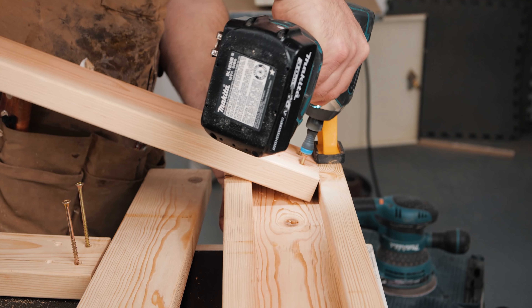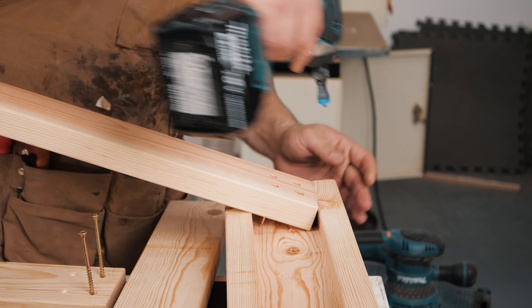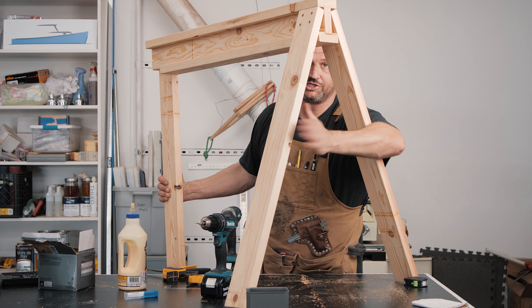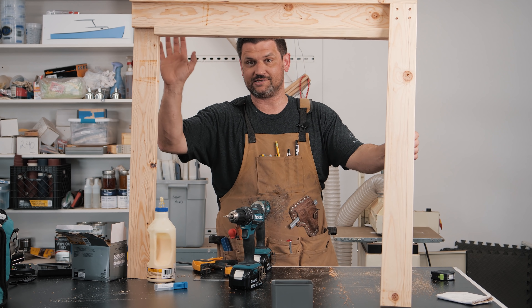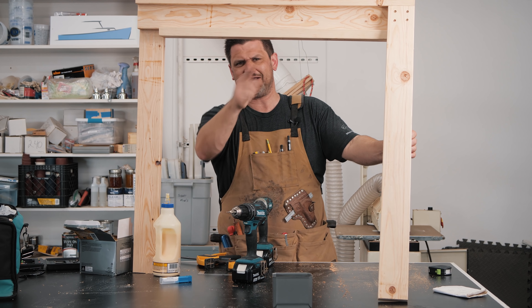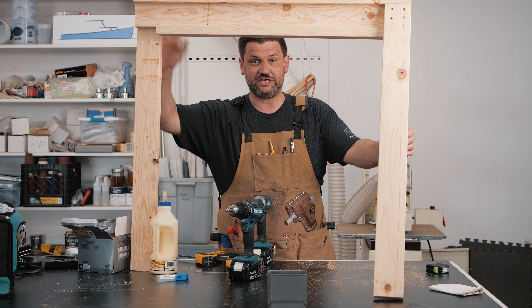Watch your fingers on the other side - if you're using the same screws as the top, they may come through. That's okay. Then you're going to flip it over and do the same thing on the other side. We just have one more thing to do, which is cut the piece that goes across. On one sawhorse you want to put it on the inside - that's the one going to stack on the bottom - and on the one that stacks on top, put it on the outside. Also I should not read a tape measure upside down. I originally said 34 and five-eighths but it's actually 33 and five-eighths - I was looking at my tape measure upside down and missed it by an inch. I'm going to trim an inch off both of these legs and use a Japanese pull saw to trim it off at the right angle.